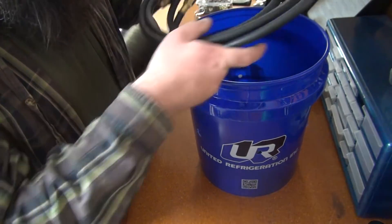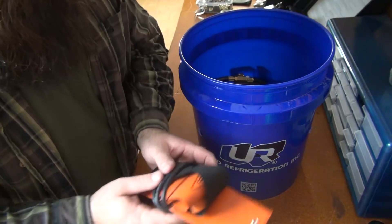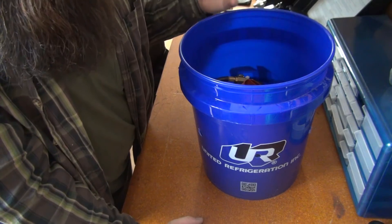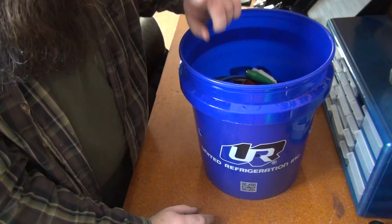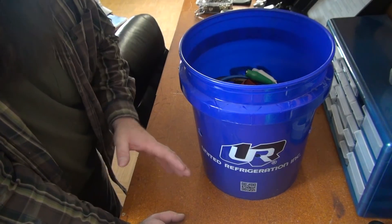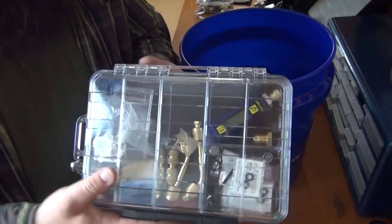Next on top of that I'm going to add a couple of quarter inch ball valve hoses. You'll need at least one in your kit to run from the subcooler to the recovery tank itself. I'm also going to go ahead and throw a tank heater into this kit — it doesn't really matter if you throw that into your recovery or your evacuation bucket, but either way it's a good thing to include. I'll slip this in just like in the evacuation bucket, but with the note and disclaimer that you absolutely should not be using these if you don't know exactly what you're doing. Test one, two, and three times, verifying that you have the correct voltage before you hook up to these things — they can kill you, and they will, and they have.